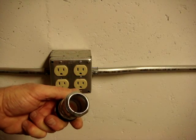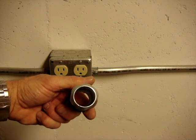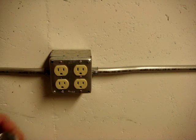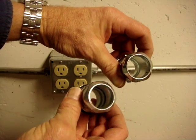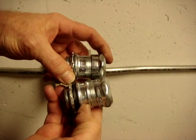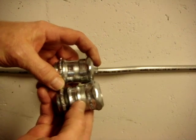The downside of this is that you can only put it on conduit once. If you try to pull the conduit out, the O-ring goes flying and is rendered useless. This is that same brand as a compression fitting. This is the watertight fitting. When you look at the outside, they look similar except that this one here has an indication to accept the O-ring.